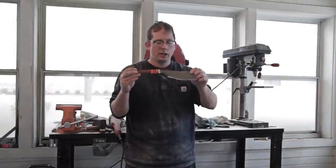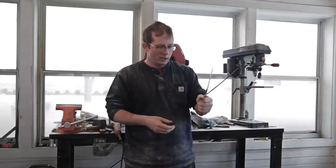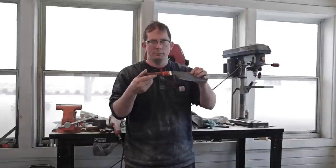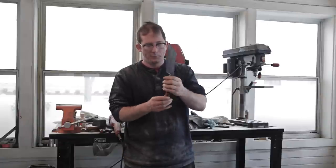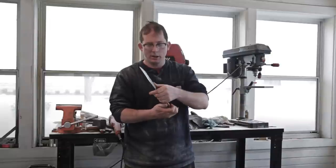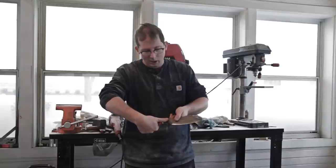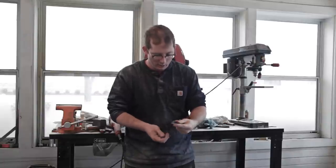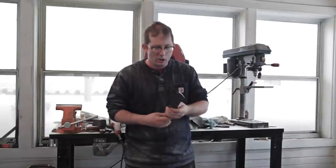All finished — this is a parang made out of a lawnmower blade and I've even got a little hamon line on there. I'm really happy with the way the balance turned out; in my mind it's perfect. I didn't put a traditional parang handle on there because I don't like the way they perform for me, but I did put a longer handle on so that if you wish you can choke back and really swing for the fences. It has a nice rounded choke-up point so you can get in and do fine work. The guard goes down at an angle so you can put your thumb on top for other kinds of work, and it'll work well with the reverse cut and all those sorts of things.